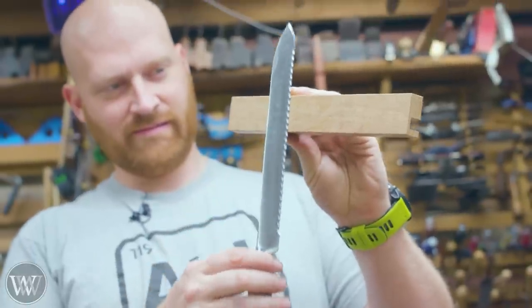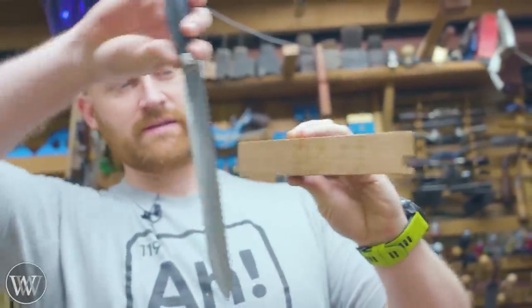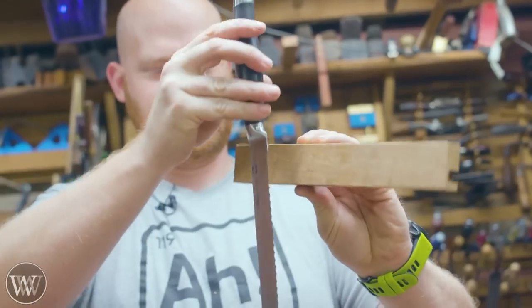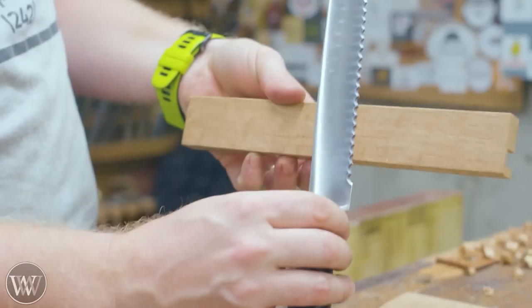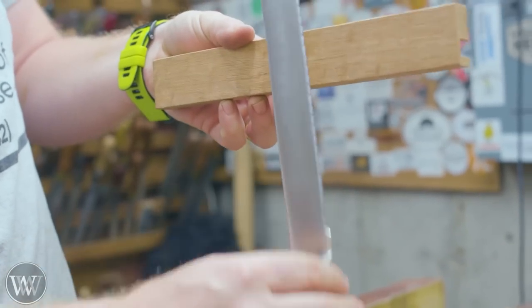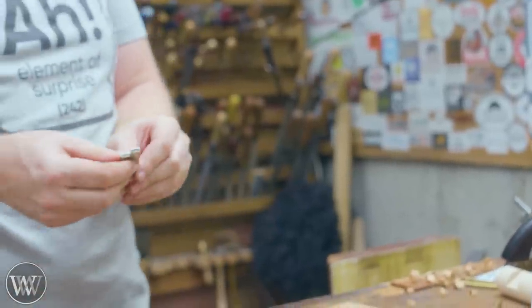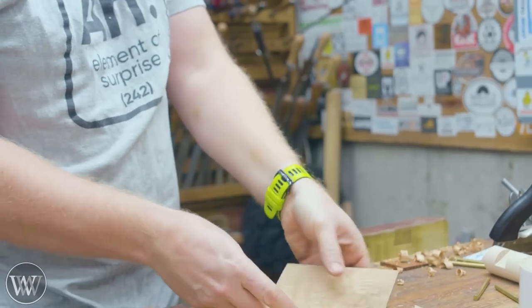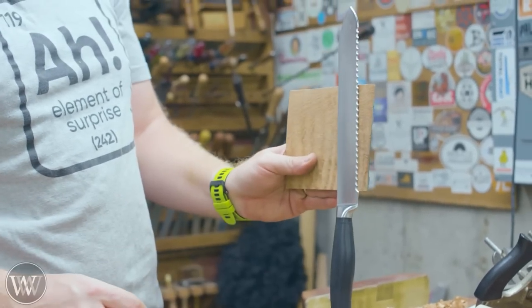And yeah, with one magnet, it holds my marking knife well, but it won't hold my heaviest kitchen knives. So I could put it like that and hope it would hold, but yeah, I need a little bit more material than just that one. So I thought, what if I put two magnets on there and doubled up the thickness? And that still wasn't quite enough. So that means I need more. And then I thought, wait a second, well, what if I ran another groove so that I could have multiple pieces on there? And that's why I ended up having four of them.